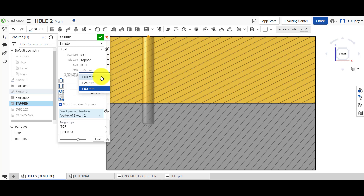It's important that if you're placing a fixing into a hole like this, you match up the pitch from the hole to the actual fixing. If you don't, your fixing might not go in, or if it does go in, you may not be able to get it out — and it can damage the actual thread created between the two parts. So it's important to match not just the size but also the pitch. The other option here is engagement — how much engagement your fixing is going to have with the threaded hole. I tend to leave that at 75 percent.